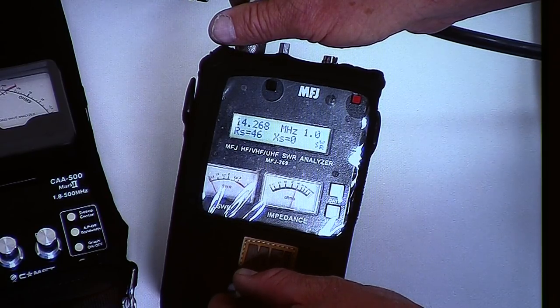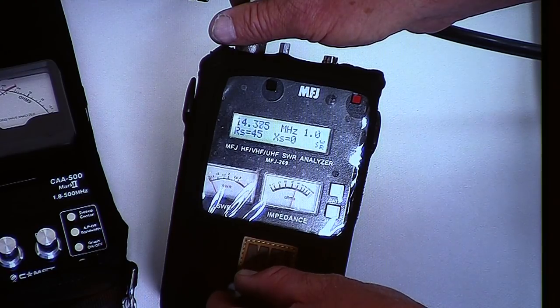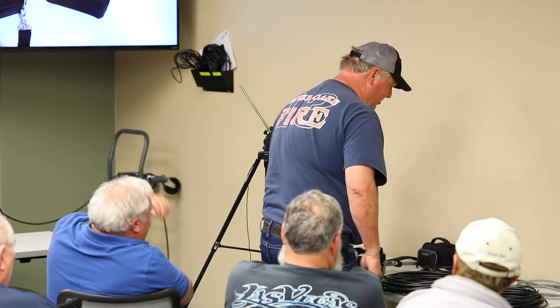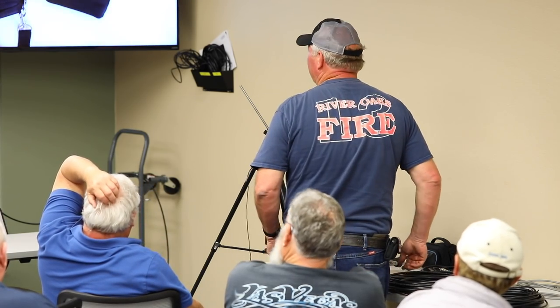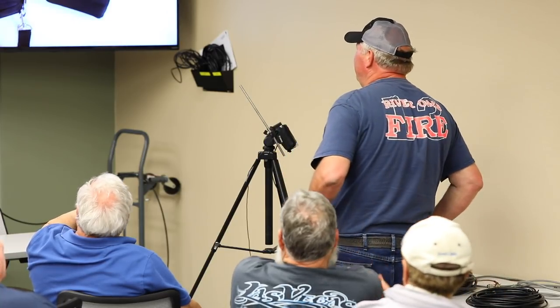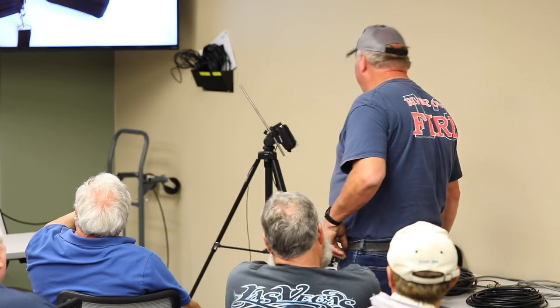14.2, look how that's holding. So it's just better coax, zero reactance. Yeah, look at that. And now you're starting to get some reactance. Now, what are those sweep dials down below telling me? One's impedance. One's SWR, exactly, one's impedance. So when you dip it, this is a half wavelength, and then the multiples are working for us.